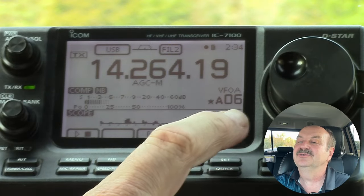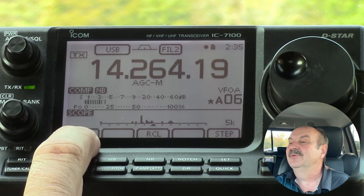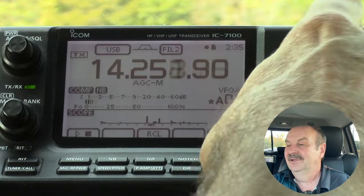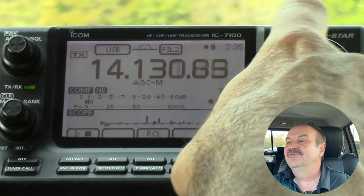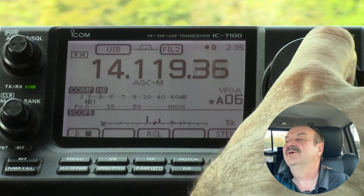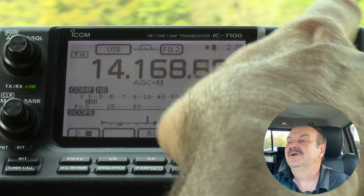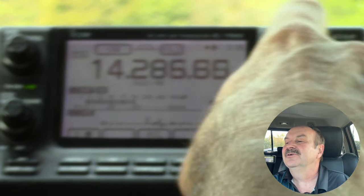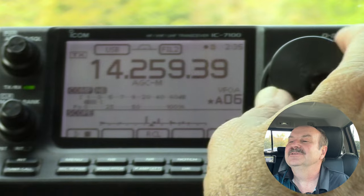For sideband, probably one or two kilohertz steps is about the most you'd want to do. If you start going five kilohertz per step, you're probably going to start missing things. That would put you real wide - five times 30 should be 150 kilohertz down. So the bottom now is basically 120, and we're off the bottom of the 20 meter sideband, which goes down to 150. And if I started at 160 - let me go back and make sure I think I started at 160.